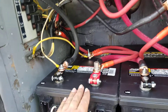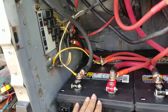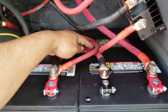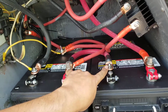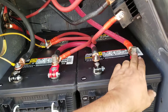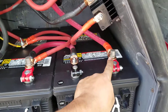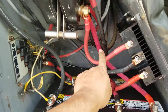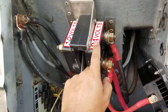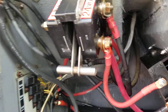Since we're pulling 12 volts from this battery, and this battery is supposed to be together at 24 volts, you can see the U-link that connects both of them together. Out of here comes 24 volts, and that's why that big 4-aught cable comes in here and is ready to go outside after we turn on the switch.